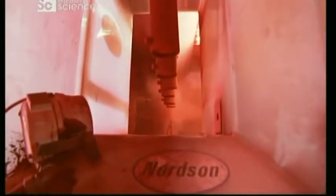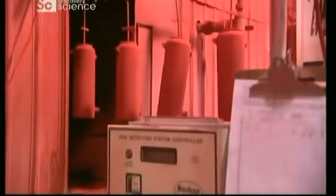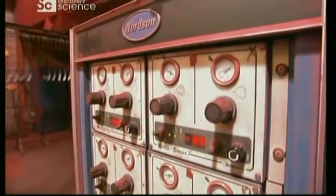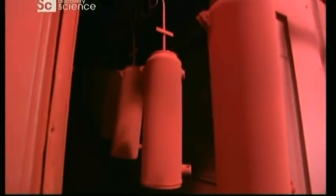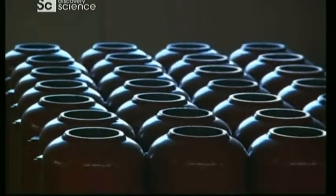And basically what we're doing here now is we're electrostatically applying a charge, a positive and negative charge to the paint and to the shell. Basically like a magnet would stick to steel, the powder paint is going to stick to that shell, and it's going to go through an oven where it gets baked for about a half hour at 400, 450 degrees. This special powder coating resists cracking, chipping, and corrosion. It's just another way engineers ensure that this extinguisher will survive the toughest fires.